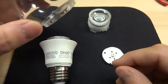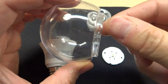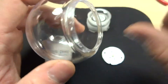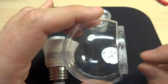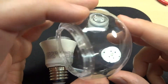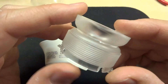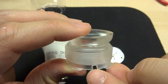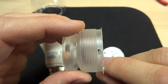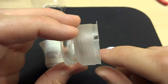The clear dome on the assembled bulb is not glued in — with a little force it comes off. There was a tiny bit of destruction when I did that; a few small pieces of plastic came off, but I think it'll go back together fine, possibly with a little hot glue to hold it. After the dome comes off, you have the light guide, which has little one-way hooks. When I pulled it off I was worried about breaking them, but checking now — all three tabs are actually intact.